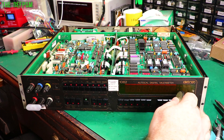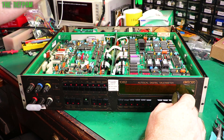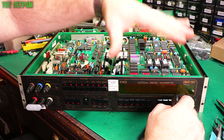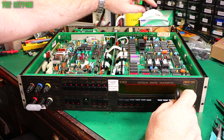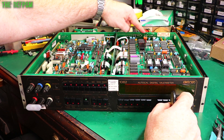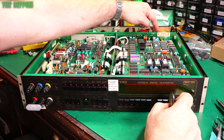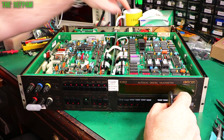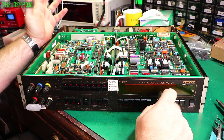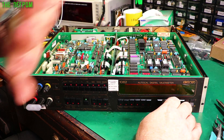I'll show you what it's doing now. I started recapping it. I've recapped the power supply section in the back here. I've actually disabled some of the power supply - the original minus 125 volt supply, which only ran the display. I've actually dismantled that section, so there's no transistors in there. The bridge rectifier I've taken out. These bridge rectifiers can be a bit flaky and can blow. When they blow, they short out the transformer and blow the transformer up. So having that taken out is a good thing - it's one less likely thing to go wrong. I've taken all that part out. It doesn't need it anyway - the display's gone, so it's completely irrelevant.